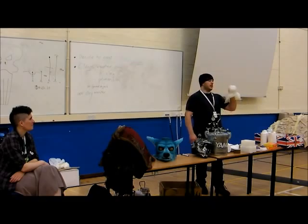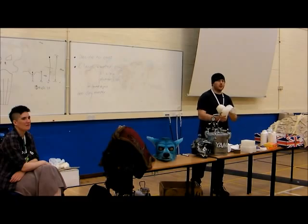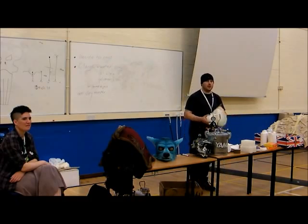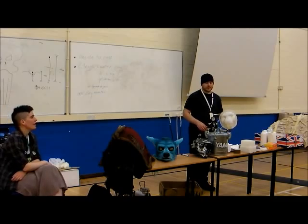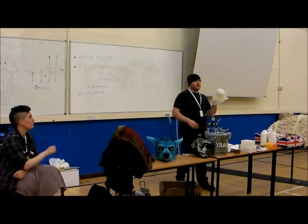That's a skin mould. So you make a skin. I tend to do skin moulds because, at least the silicon I was using, it would only do a thin layer, and the more you try and build, it just kind of blurts. You can do multiple layers of silicon, so long as you do them quickly.